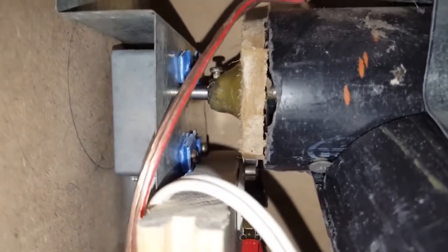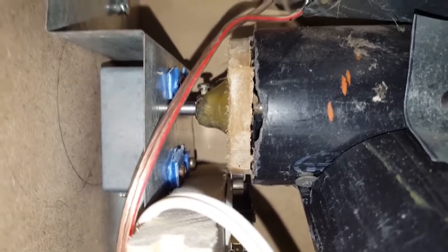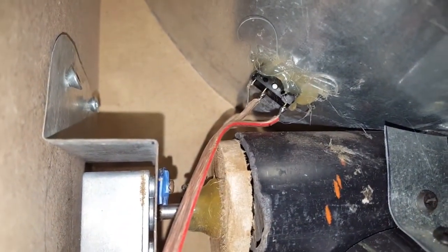Here is our cam with a tiny roller switch — this counts how many turns. For two cups of food we counted six clicks. This is a tiny 10 RPM, 12-volt motor we got from eBay, I think it was $10 or $12. This is the switch for the low food level.